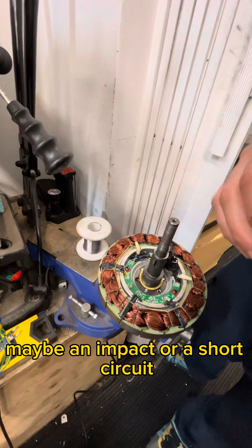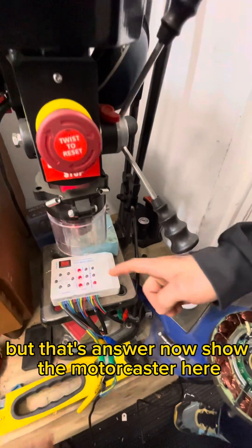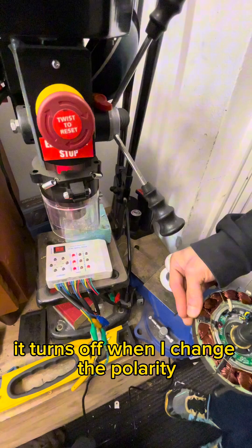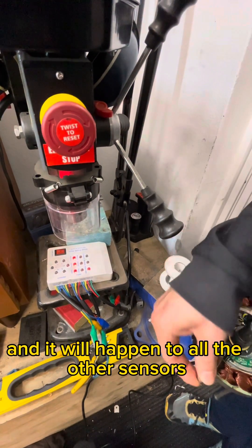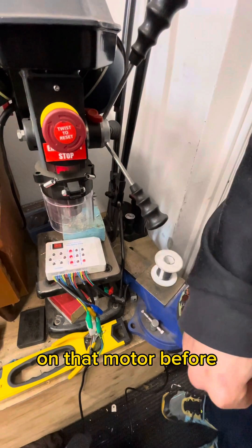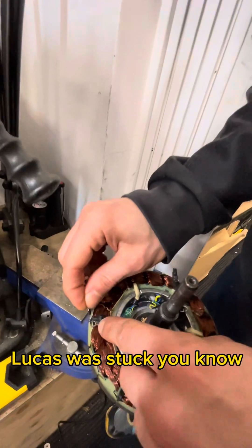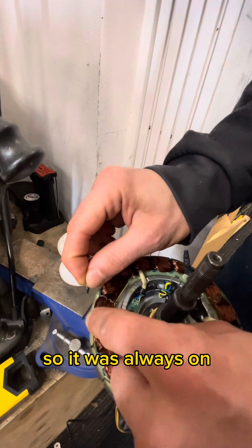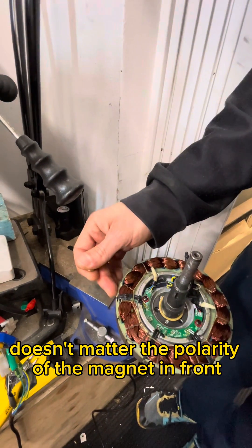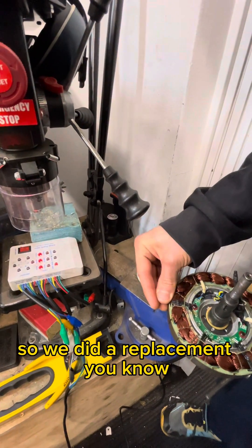With the motor tester, when I change the polarity it turns off, and when I change the polarity again it turns on — and that happens with all the other sensors on that motor. But this sensor over here was stuck: it was always on. No matter the polarity of the magnet in front of it, it wasn't changing the light.